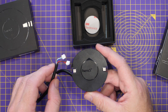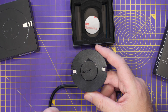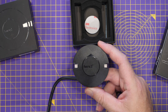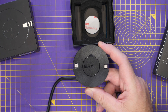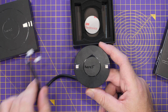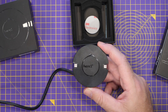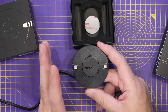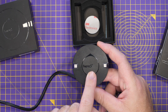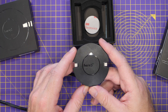There are two CAN headers on this, and at this moment in time only one of them is active. The reason there are two CAN headers is not only because of that STM32 H757 CPU, but there is also a Remote ID module built into this GPS unit as standard that will be available for future use via ArduPilot — and that is what is going to use the other CAN input. That is really interesting to see; it's the first time we've seen it from any manufacturer, and whilst it isn't available to use today, the hardware is built in, ready to be activated in the future as we see Remote ID propagate around the US.